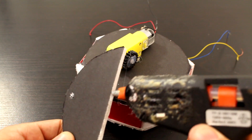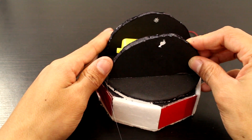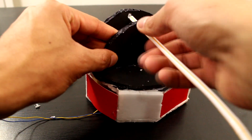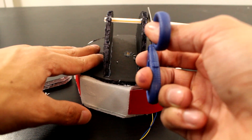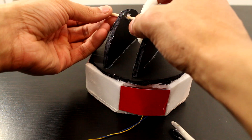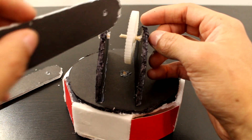Now we're going to start building the part that does the rotating part of the arm — the up and down movement, I guess you could call it. We're going to drill a hole in the arm part and stick a straw through. I use straws often as something for the axle to rotate inside of; it gives less resistance than the wooden axle rotating inside of the foam. I attach that in there, glue it into place, and then stick a gear through it with an axle. We'll cut that down to size, then go ahead and add the arms onto the gear.